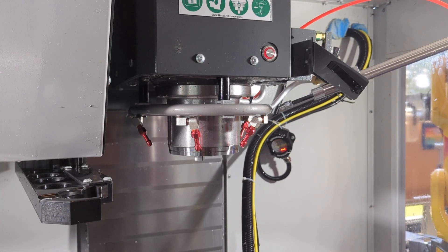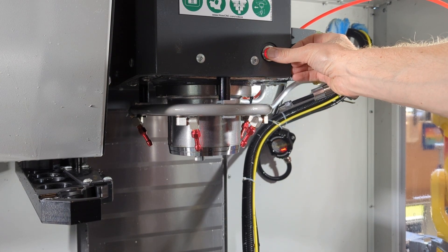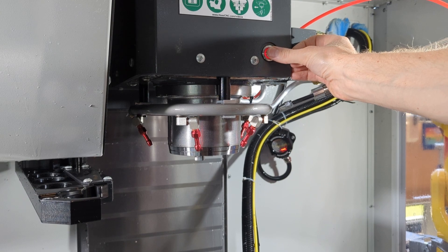What's critical as we proceed is that your spindle has no tool in it. If you're not quite sure, just ask the helper before proceeding. Reach into the mill and push the load-unload button and get ready for a loud rush of air. Practice pushing it several times until that sound no longer startles you.